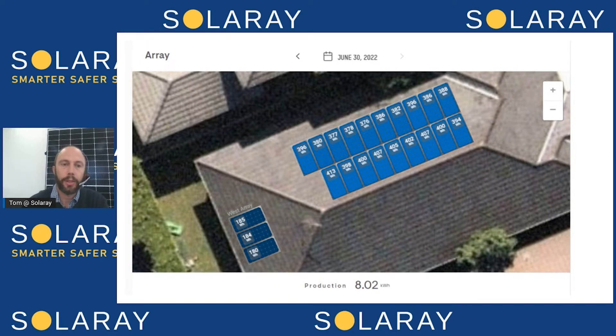On this system we've also got a few panels facing west. Many households have time-of-use billing where you pay a lot more for power between 2pm and 8pm. So we'll often fill up any western roof with panels just to help generate as much electricity as possible later in the afternoon. This photo was taken in the morning, so you can see the west-facing panels haven't really kicked into gear yet — they're underperforming compared to the ones facing north. But as the sun gets around to the west, the western panels will then start to output a lot more power.